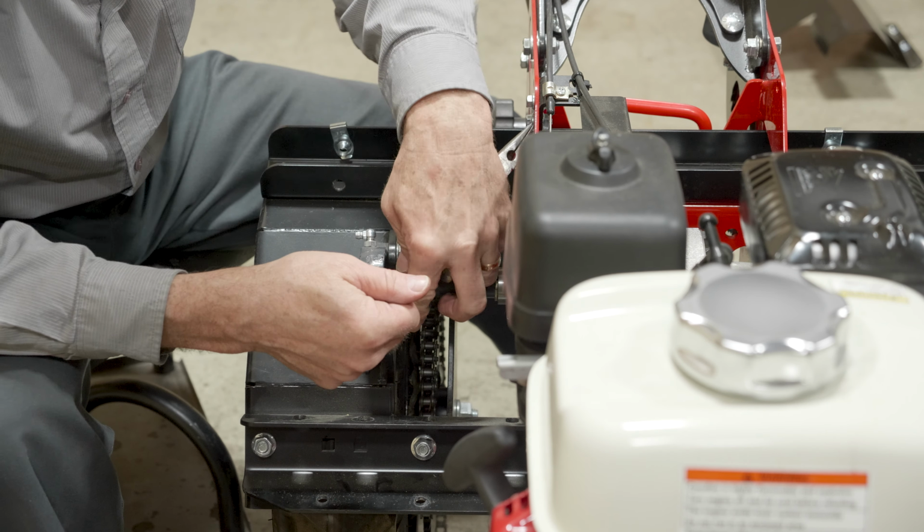So on this shaft, you'll see there are these half-moon indentations, and a Woodruff key is in a half-moon shape. And that's where either our needle nose or our screwdriver comes into play. These things, they're seated in there pretty tightly. So sometimes you have to try to get underneath, maybe give it a little tap.